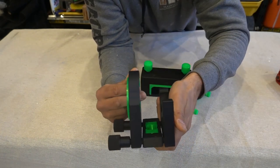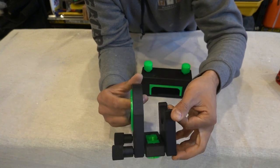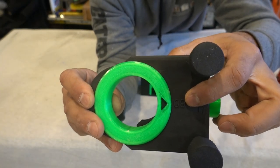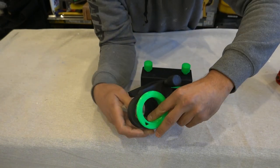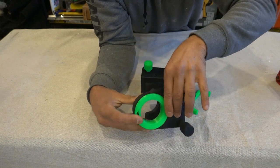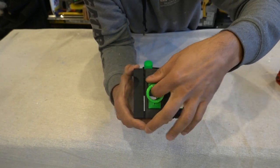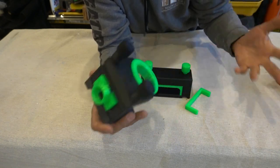On the front we've got adjustable lugs to clamp everything on — that'll accommodate a 35mm, 40mm, and even a 45mm door. We can pop out the insert; there's a little arrow marked '60' so that's a 60mm offset. Swap it around and once locked in place we've now got it set at 70mm. Nice and simple — the biggest game changer is the ability to recess our latch straight off this jig without doing anything else.